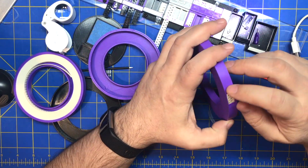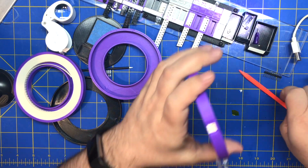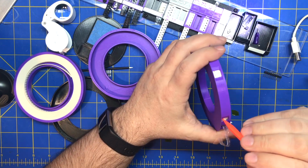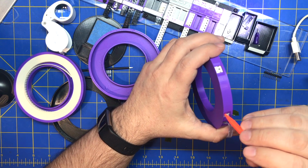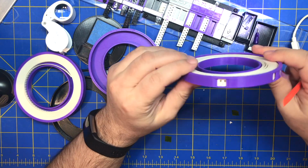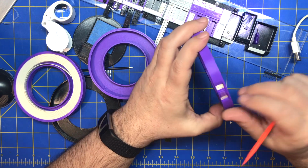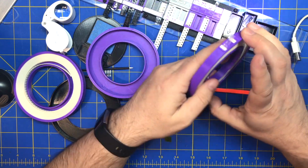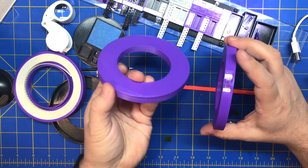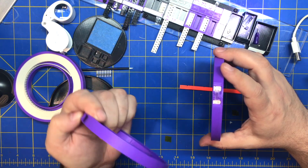So this is revision 2. I made the hole a little bit taller. I added these two other holes so I could try to do some alternate stuff with this. Maybe pull the tape out and use it as a kind of feeder. It didn't really work that great. I probably need to move the hole over one so there's not so much friction against the curve. That's why I put two of them, to experiment with their position.